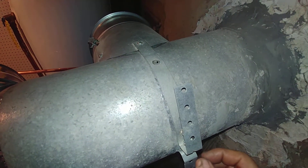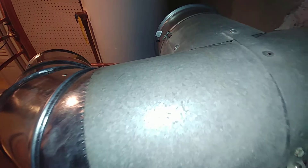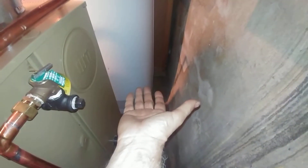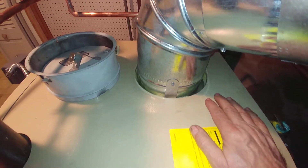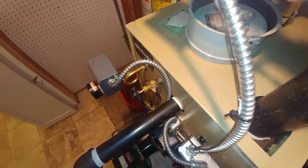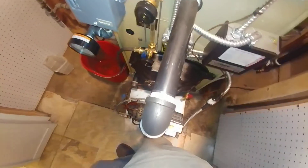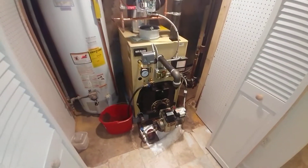There's the back of the original 7-inch flue there. Normally we come out the back, but there's just not enough space here to make this transition, so we've capped this off and we're coming out the top here. It makes it a little harder to get this top off without taking all this apart, but I think we'll be okay. And the way Steamhead sets up these burners, this thing will probably require no cleaning at all.